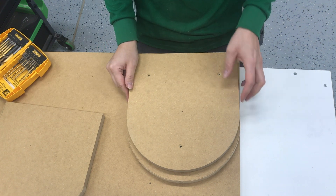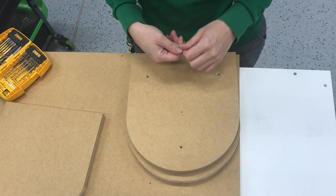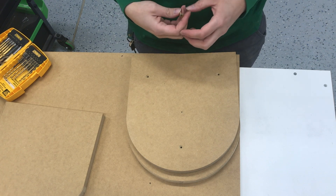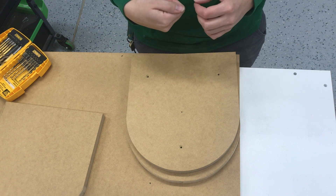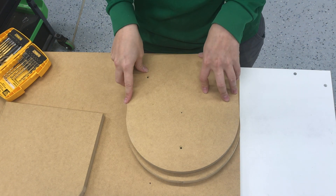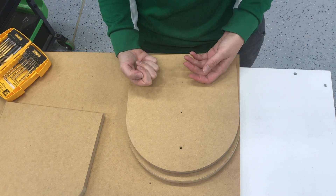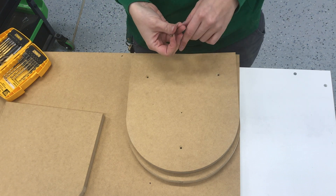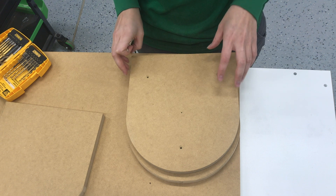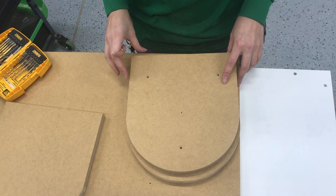A third option is to use double-stick tape. The film-style double-stick tape, which is used for turning and applying golf handles, is incredibly strong. It's activated by clamp pressure and you only need a little bit of it to create pretty much a permanent bond. Carpet tape also works really well. For me, I want the most versatile but probably more time-consuming option, which is going to be screws.